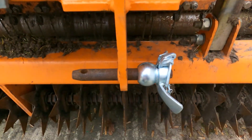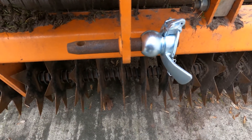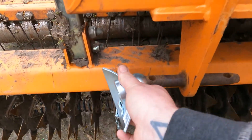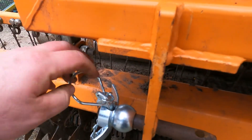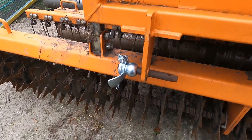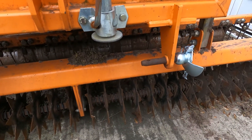Pin skewering it and the ball ready for attaching to our new hook arms. Same over this side — we'll just remove the pin, slide it on, line the hole up, pin goes through the top, box down, and we're now ready to bring the tractor around and get the hook arms on.